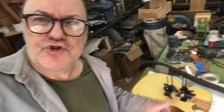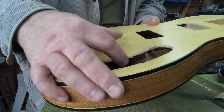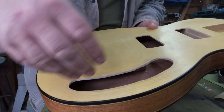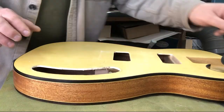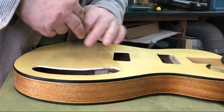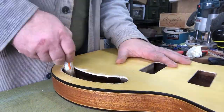Because I want to cut out a control cavity — I've just chopped out this shape for it. Again, this is a bit weak here; it's just a bit of spruce and there's a little piece which is unsupported, so I think another piece of mahogany stuck to the inside is what's going to happen there. We've got some cleanup to do — I just want to make these sides a little bit more neat. Bit of sandpaper wrapped around a pen — works a treat.